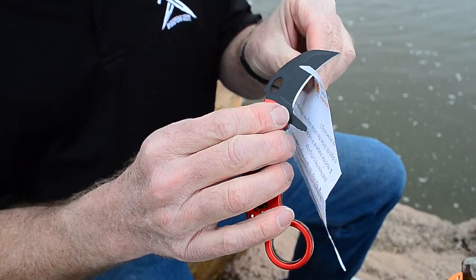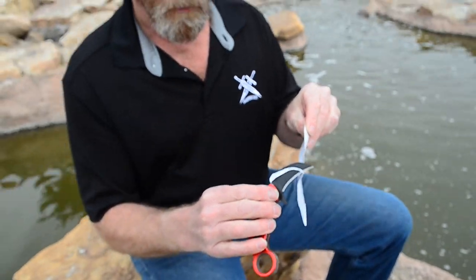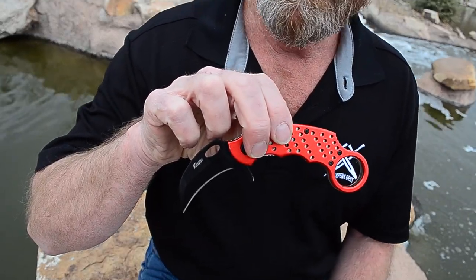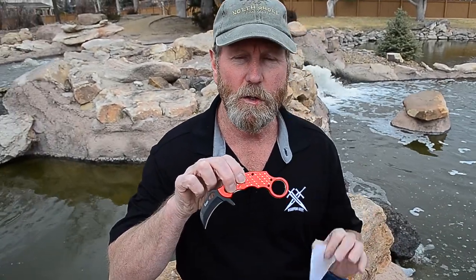That's sharp enough. If you make a knife too much like a razor blade, what's going to happen is it'll be so thin it won't be tough. Sharp means thin, thin means sharp, but thin is not tough. For a pocket knife, keep it pretty tough with a little bit sharp. Don't make it too much like a razor blade or you'll roll the edge or nick it. My real cutting knives are down around 11 degrees. This is Brad sharpening an inside radius on a Karambit style knife — it took about two minutes to make this brand new knife sharp.